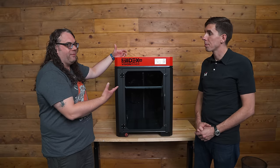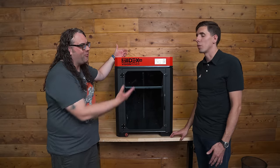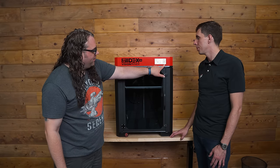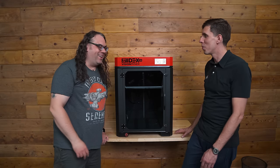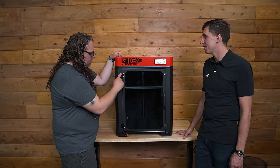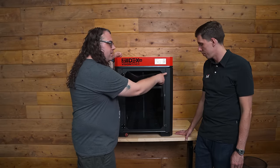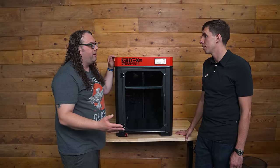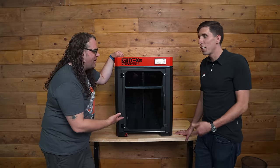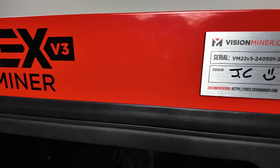Normally you'd just send a file to it and monitor from a computer. If you have a company with 20 of these, you're not going to stand at every screen waiting for prints to finish anyway. One thing we've done is include RGB LEDs inside the chamber — you get status colors as it goes through each part of the print. If it's ready, it's green or blue; it changes color while printing, and again when it's done. For a fleet of machines in your warehouse, you can glance and see which ones need attention. Most people have a camera in that area anyway, so you can check remotely. The LEDs also run along the sides for good lighting so you can see your first layer going down. There's also a solid door seal to keep everything contained.